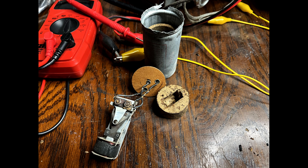Regarding reinstallation — as you saw on mine, the wire insulation became quite brittle and was just flaking off. So if you want to do it the right way, desolder the wires, put some shrink tube over them, shrink it down, and solder the wires back on. Or if you want to be lazy, just put electrical tape over each wire along its whole length and it'll work fine. For reinstallation, because the vibrator is held in so tightly, you don't actually need to crimp the case back down. You can just shove it back in and it'll stay and work perfectly fine — which is good if you need to remove it again later to fix something, because you didn't have to re-crimp it.